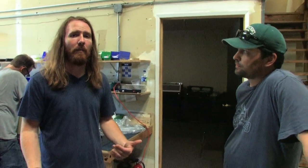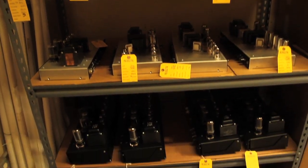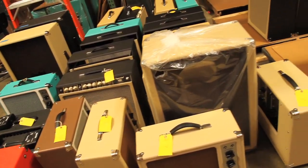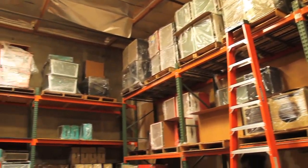All right, cool. So the amps leave the cook rack. They get about 10-12 hours of initial signal put through them, and then... Yeah, exactly. So at that point, we have our final testers grab the amp off the cook rack, put it onto an initial test cradle. It gets tested, cab it up, it goes back into the test room for a final test, and then out to shipping. Nice. And that's where the tone comes from.